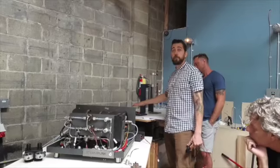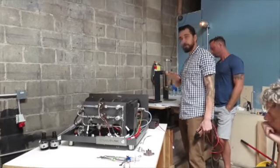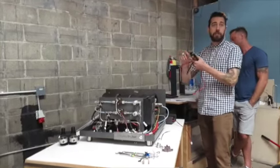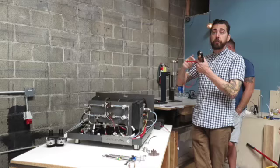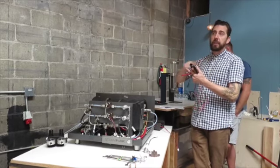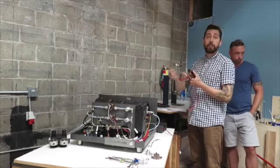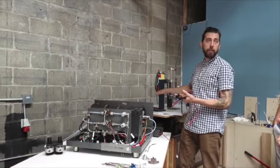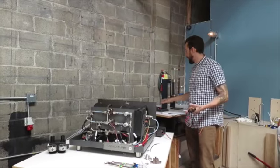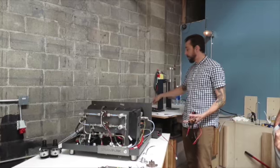So as long as everything looks appropriate, then you can go through and start running your other tests. If you see something that's wrong, turn it back off, double check that your connections are on there appropriately. Whether the temperature looks super high, then the wires could be touching and you're getting a short, so it's not getting any resistance and it thinks it's really high. Or one's not connected or touching something else, which would be the worst case scenario, and it's still getting a wrong reading. So you should be able to tell, is that a reasonable reading for the situation, both boiler and the crucibles.